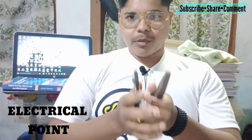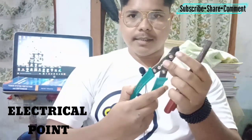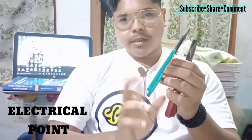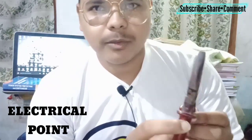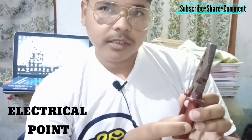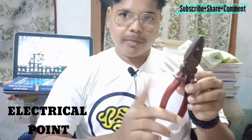The next important point is about your tools — wire cutters, pliers, testers, screwdrivers. When you are buying these from the market, always check the insulation part. The metallic body must always be properly insulated. If the insulation is damaged, there will be electric leakage through the metallic body and that will give you an electric shock. Always verify the insulation is proper on all your tools.